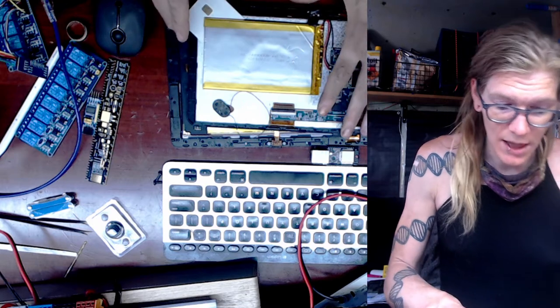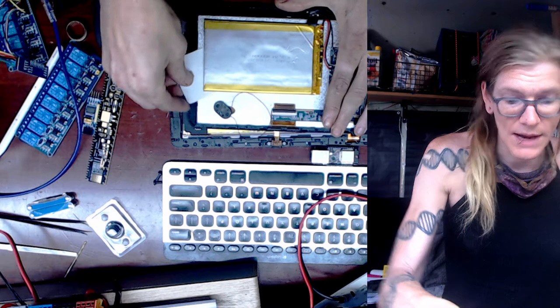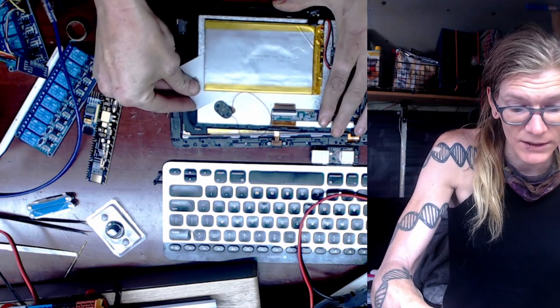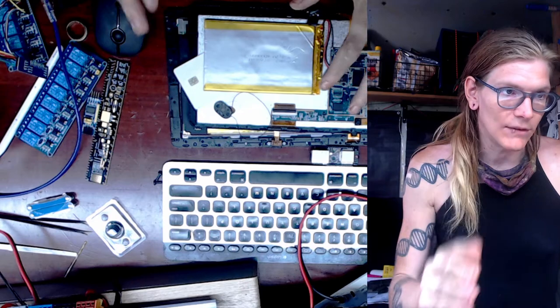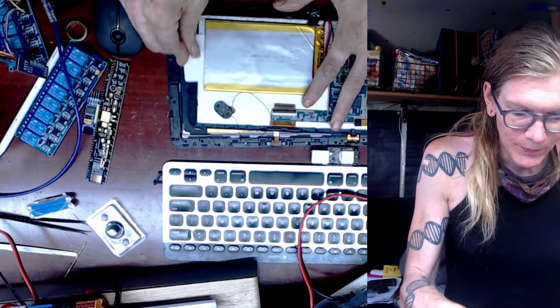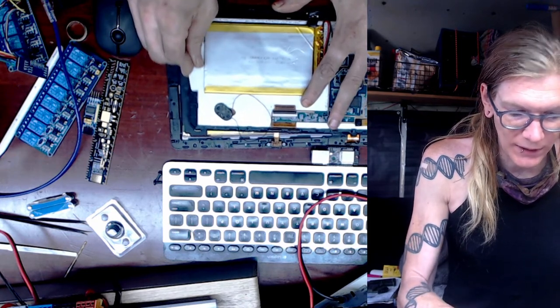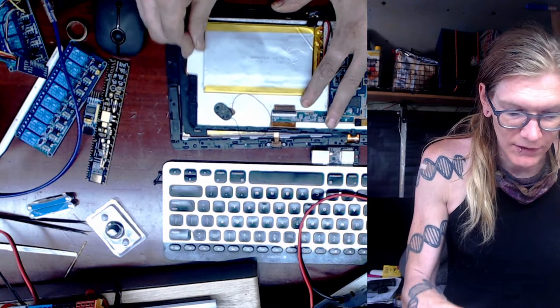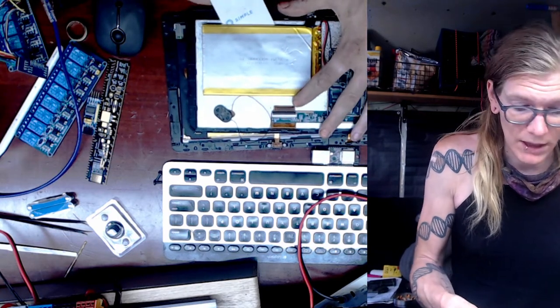In fact, the reason that the Samsung batteries blew up was because they manufacture them to such tight tolerances that the edges would eventually wear out and then short. You need to have a little bit of margin of error when you're manufacturing these, and especially when you're reclaiming these from old electronics. Have to be very careful about how you're removing them.